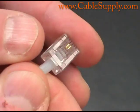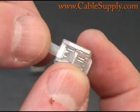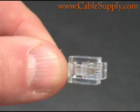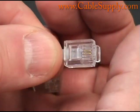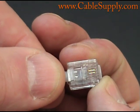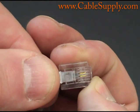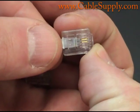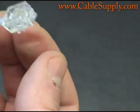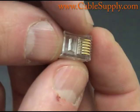Now everyone's using VoIP and RJ45s, which are used for computers. But as you can see, this only has two wires — those two pins — that makes an RJ11. Now if it had four positions it would be an RJ14. Some older phones that have two lines needed RJ14s, and in that case you just put four wires into your mod plug and crimp it down.